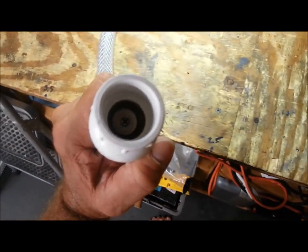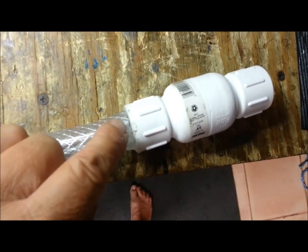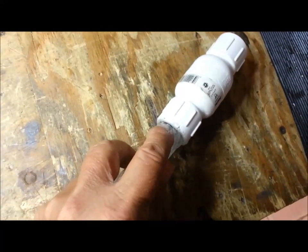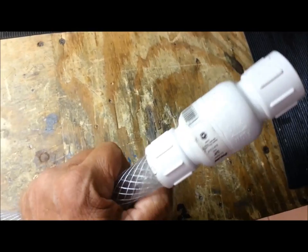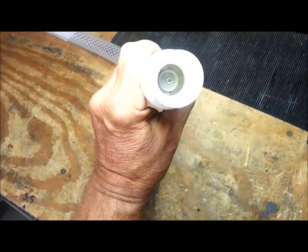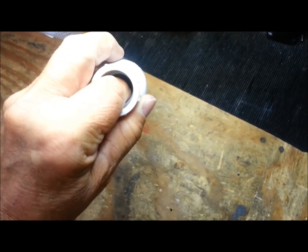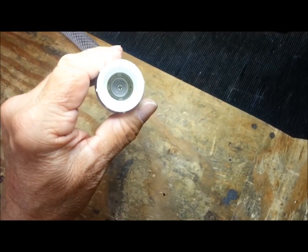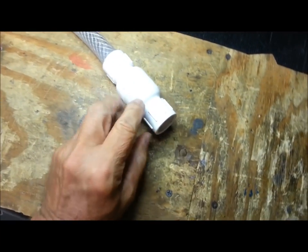This is a three-quarter-inch check valve from Home Depot. What I did was heat up the end of the hose and expand it a little bit with my screwdriver, put a bead of Lexel inside and around it, shoved it in there — it's nice and tight, glued in there with Lexel. On the check valve I removed that screw, it's a one-way valve, and I took two turns off of the spring, then hooked it up to my Sahara 500-gallon-per-hour bilge pump and it opens up very easily.